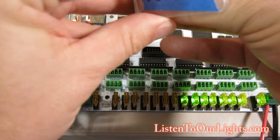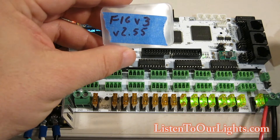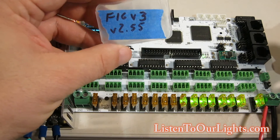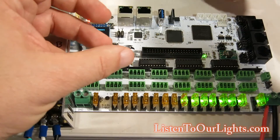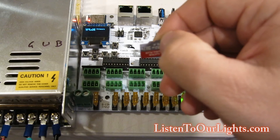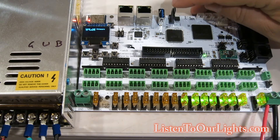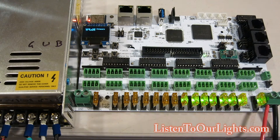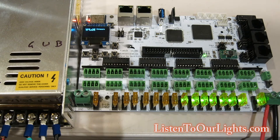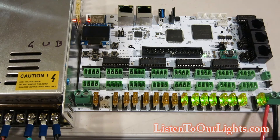This second card has the file for the firmware update, the .FL2 file — this is version 2.55, which is the most current version, also downloaded from the Pixel Controller LLC website. I'm going to take this card, with the gold sides pointed towards the little screen, and slide it in. The instructions say to place the FL2 file micro SD card in the slot, then power down and power back up. Powering on, it says 'Bootloader V2, erasing flash', and it will stay there for a while.